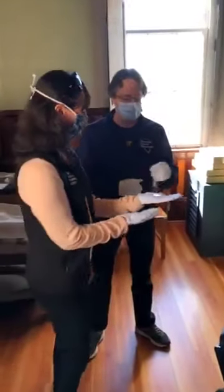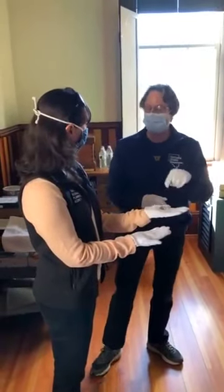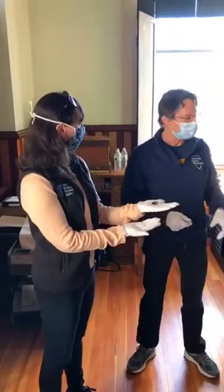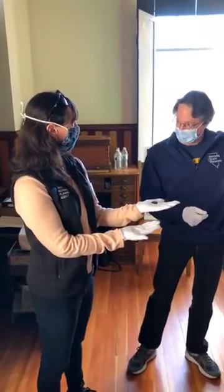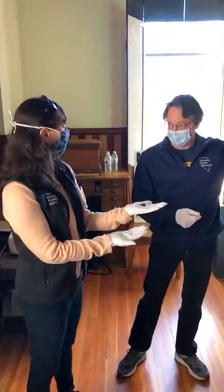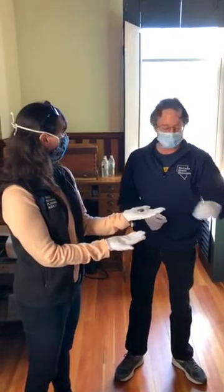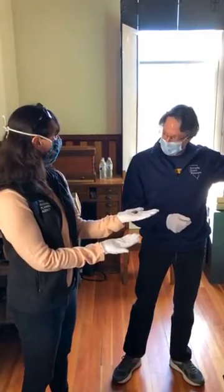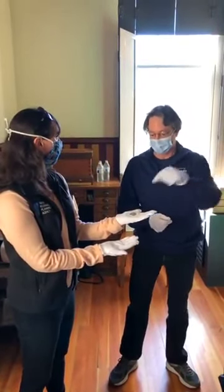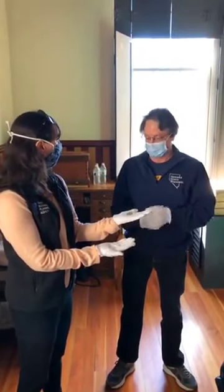This is 30 millimeters. It's a half ounce. And the reason we mint this size, because people used to get the dollar size, is because our primary job is to take care of the coin press. It's the most precious and historic artifact in the museum. And so by minting this size, this machine has no problem continuing to operate pretty much indefinitely minting something that size. So that's why we shrunk down the planchet size.